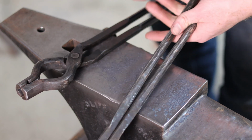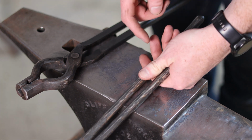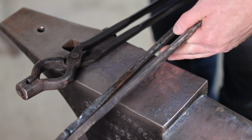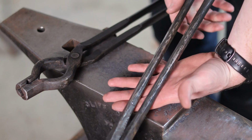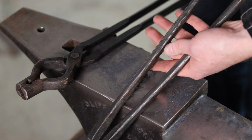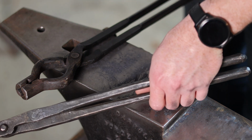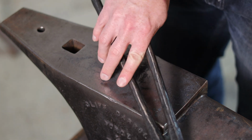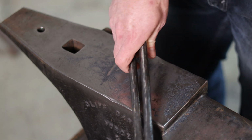And the reason for that is because if you are letting go of a pair of tongs to let go of a piece, you want to be able to hold on to this rein with your thumb and the inside of your hand while letting go of the other rein of the tongs, so that you can just let it go, and that the tongs will kind of naturally fall into your hand as opposed to away from. This tends to be the most comfortable way to hold a pair of tongs, which is why most people just forge a right-handed pair of tongs, which is made for use in your left hand or your non-dominant hand. If you are left-handed and your right hand is your non-dominant hand, you will actually want to flip-flop where the reins are and twist to the left in order to make those tongs more comfortable in your right hand.